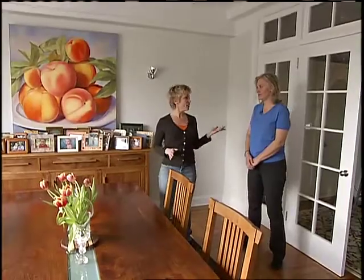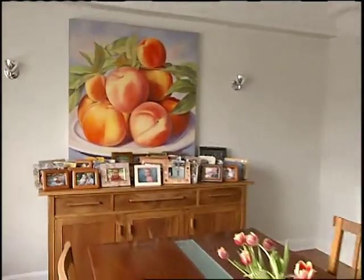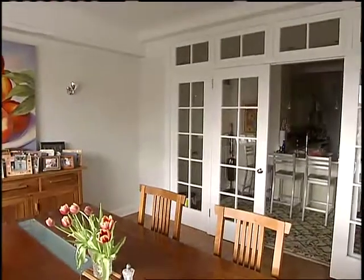Marissa used more subtle colors and lighter textures in the first apartment, but in apartment number two she used darker colors and more prominent textures. What you see behind us is another example of the veiling technique, although this room feels dramatically different. This room has a more contemporary feel — we used a light base coat and several layers of a darker glaze, which gives that shimmering effect and contrast. Veiling is very quick; you can do five or six coats in a day.